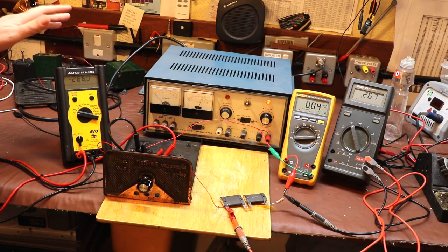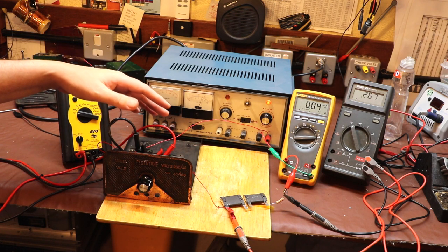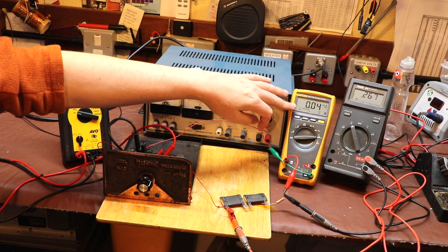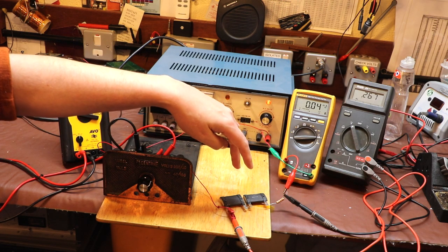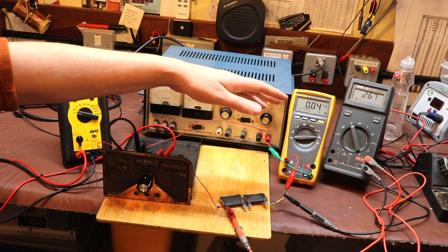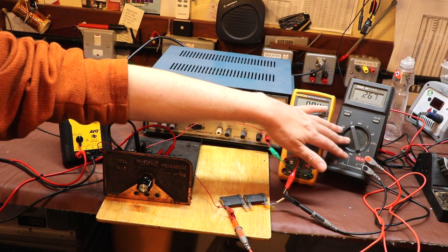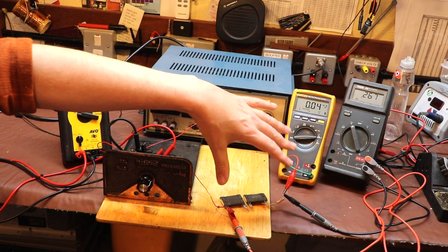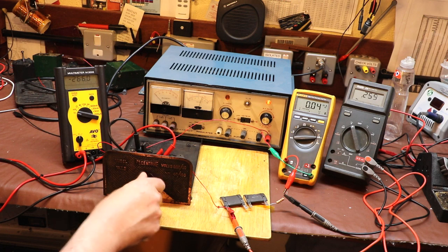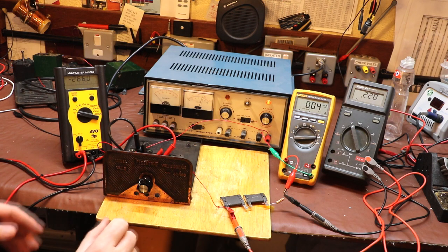So I've got some meters on the bench. This meter is going to measure the voltage across the rear stack. Another meter is set to measure the current through our load, and we're using the same load as last time, so this should give us something in the region of 20 milliamps when it's got 170 volts across it. Then another meter, set on the volts range, is measuring the voltage across our load. At the moment our potentiometer is fully screwed out, so there is no compression on that graphite material, so we shouldn't be getting any current flowing.